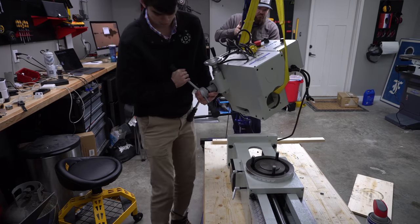Well, that was awesome. Some of these machining marks that were left on the surface indicate that the mill's tram needs to be adjusted a little bit more, but I'm happy with this quality for now, especially with this inexpensive facing mill that I bought off of Amazon.